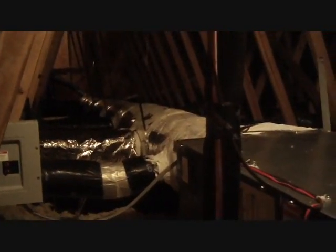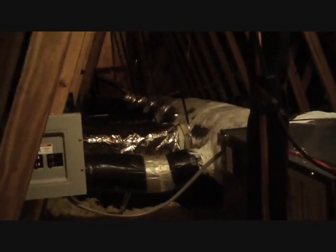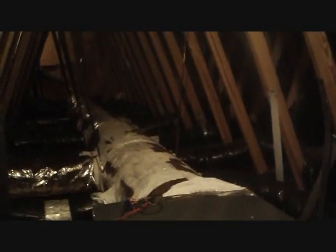The duct work is all done. I've finished tying in all the run-outs. We mastic all the seams on the top — that's our return elbow, we have to insulate it. A little mastic on there so it can't pop off, and we are good to go. We'll seal it back up. Let's take a look at it running outside and then we'll be done.